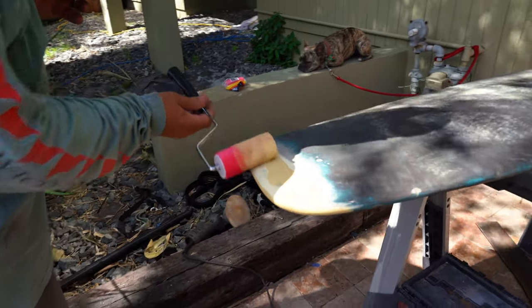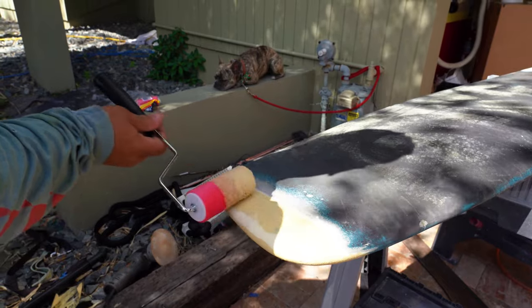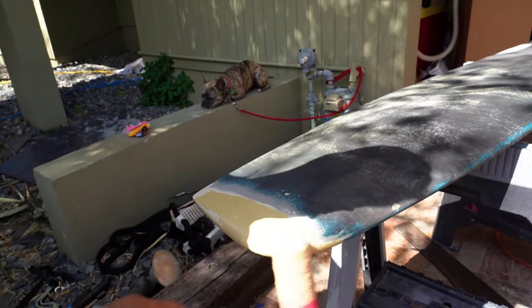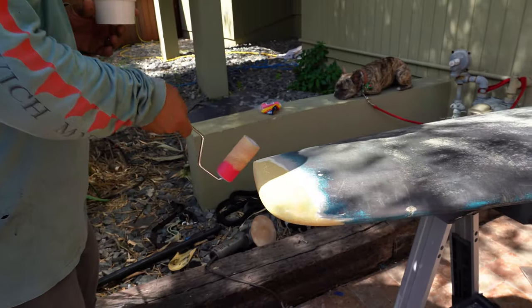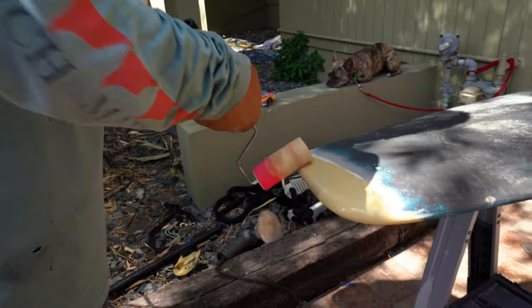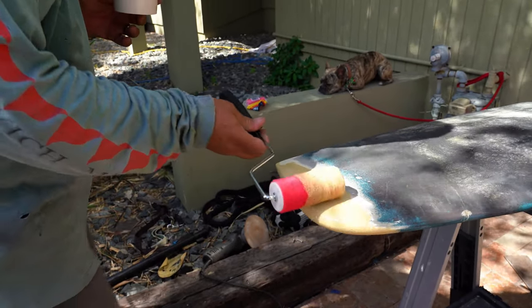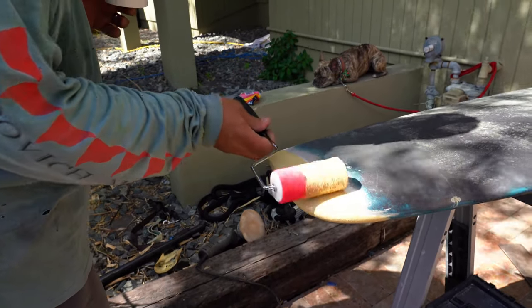First, what you want to do is distribute the paint evenly, and you want to soak the roller before you go to the edge. You know what I mean? Yeah. So this is where we want more. More millage, you know, because then you're going to fade out. And look, it's nice, beautiful. As you're fading out, it's thinning out.